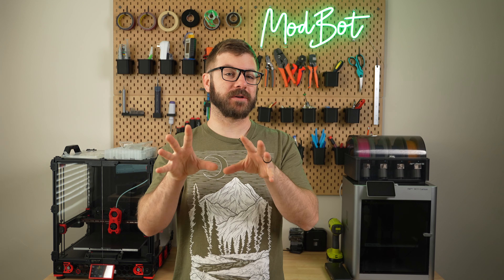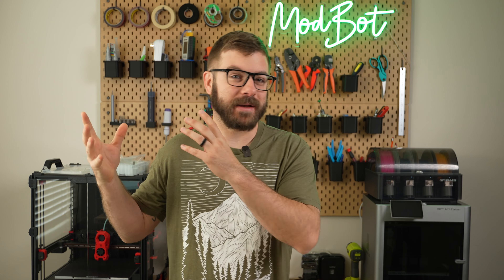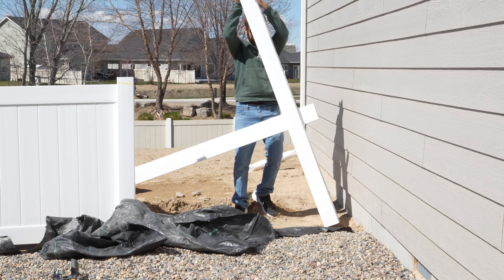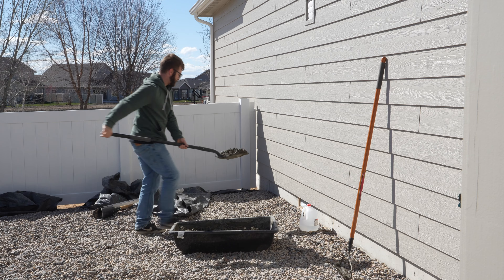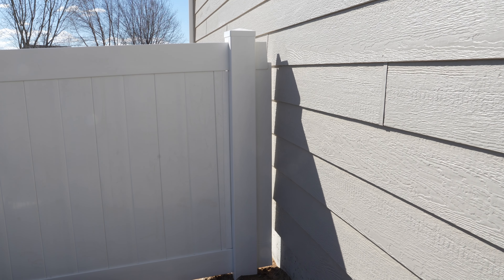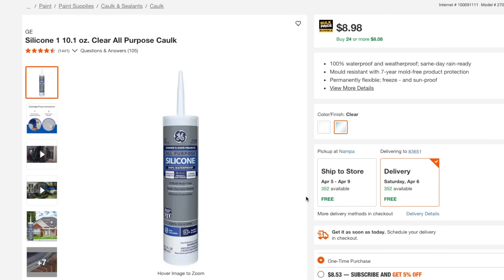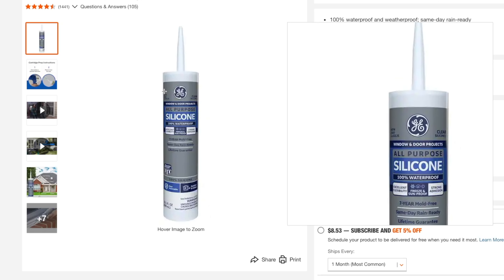Now that I had my post, everything else went smoothly — well, no. The fence isn't meant to be cantilevered and we're modding the fence, which sounds silly to say out loud. Trying to get the horizontal beam into both posts when I had no wiggle room against the house was incredibly challenging. I ended up having to bend things in ways that weren't meant to be bent, and my second cut had another chunk or two taken out from trying to shove the horizontal rail through. I also had to cut the top horizontal rail, so now the picket sticks out a little bit at the top instead of being perfectly flush. I picked up some silicone caulking that I'll apply around the two openings I cut out — this will hide the cracks and keep any water from making its way in.